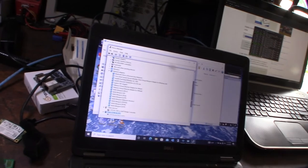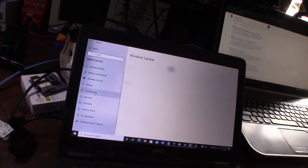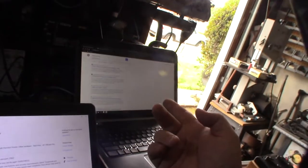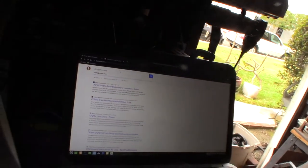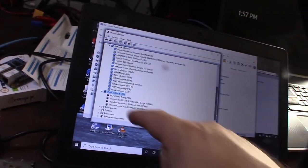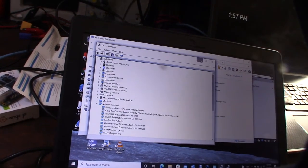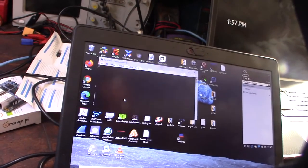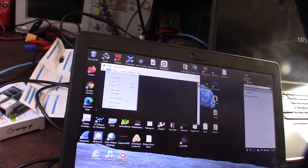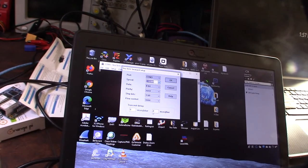On Windows it showed up with no driver. We found a possible update and downloaded and installed it. I'd prefer a driver that was tested on Windows, otherwise I'll install one from the internet. The kernel should actually support this on Linux, so I'm not sure what the issue was. Once installed correctly you see a COM port — this one is on COM3. I'm going back into TeraTerm. You can use PuTTY, TeraTerm, or the old HyperTerminal. I'll hit Serial, COM3, and open the port at 115200 baud.